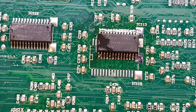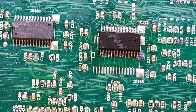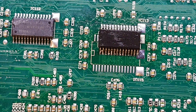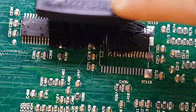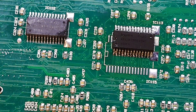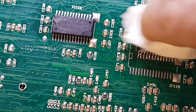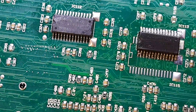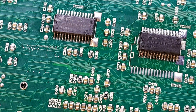You can go over it a couple of times if you want just to make sure. But of course it's all in the visual inspection — so we've soldered it on. We now need to clean off the flux using some isopropyl alcohol. I'm just using one of these anti-static brushes. Of course it's not essential to do this, but it is best practice — so if you've got it, definitely do it.